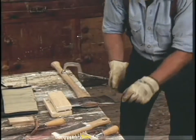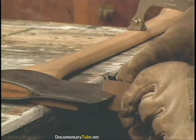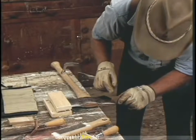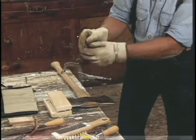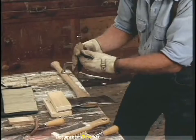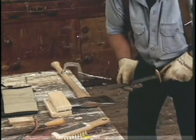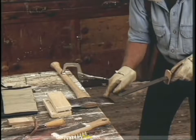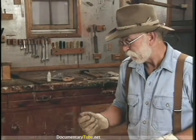I'm going for this 25 degrees right here, except it's a little too thick back in here, so I'm going to have to file the cheek off. It shouldn't be a straight 25 — it should have a slight curve to it. The finished shape is going to be a half-moon, filed more back into the cheek. Remember, I'm not just sharpening this — I'm rehabbing this axe and then sharpening it. If you take care of your axe, you can touch it up in 15 minutes with a file and the stones. But when you're starting over with one, it takes about an hour.